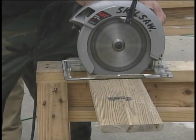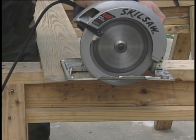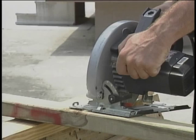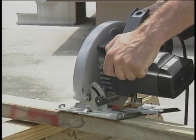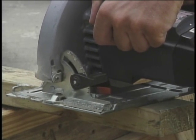Push the saw forward at a speed which allows the blade to cut without laboring. Never force the saw, use light continuous pressure. Hardness and toughness can vary even in the same piece of material, and a knotty or damp section can put a heavy load on the saw. When this happens, push the saw slower, but hard enough to keep it working without much decreasing speed.